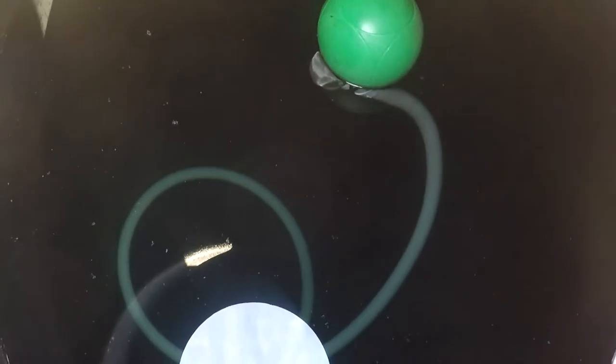This part here is going to be a little hard to see because of the sun reflecting off the water in the tank. But the water free flows off the roof through this inlet into the tank. And because the water comes into the top, it keeps the debris from getting stirred up. If it came in the bottom, then every time water came in the tank, it would stir up the debris.